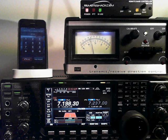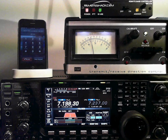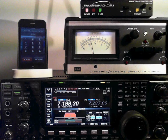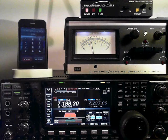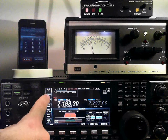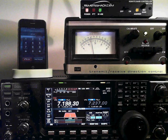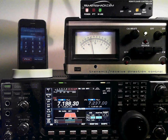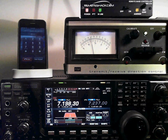I'm going to go ahead and turn down the receive audio a little bit so I can show you more of the functions. Let's go to antenna menu, menu number 2. From here, we can switch antennas. Right now we're on antenna 2. I'm going to go to antenna 1 by key number 1. Antenna 1. We can also take our tuner, control our tuner, put it in or out, and also tune the antenna. That's with keys 3, 6, and 9.